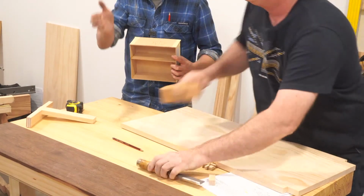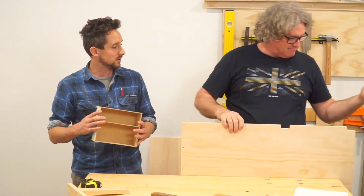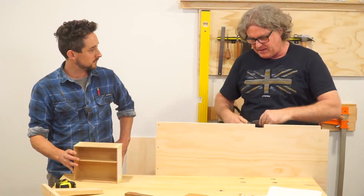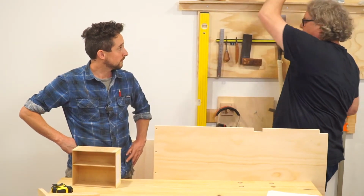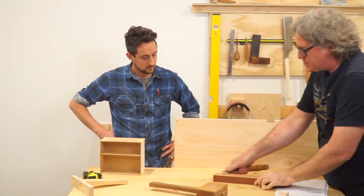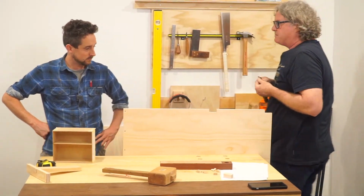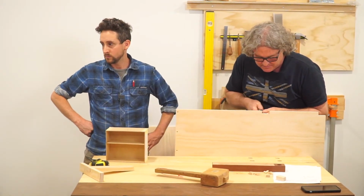So you've done a number of relief cuts? Yeah, I think on this one, on the end cut, you can just use the saw, cut down right across the grain and down along the grain. Yep. On this cross cut, I'm going to pare that. Now, if you've got a chisel that's a little bit dull, well, this one's okay, but it's not 100%, rather than going back and resharpening, you can just strop your chisel a little every time. It's a two-sided strop, just to bring that edge up a little. Because with pine, you need a sharp chisel, otherwise it just won't cut it.